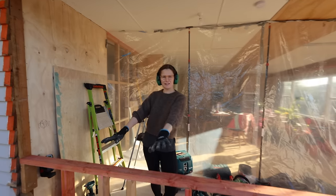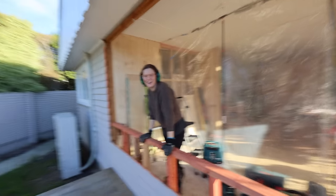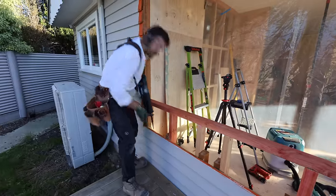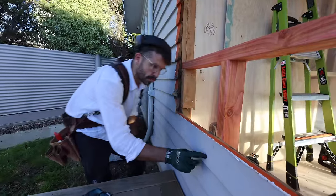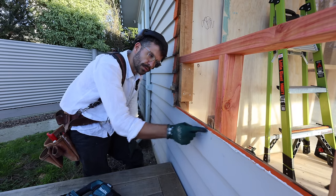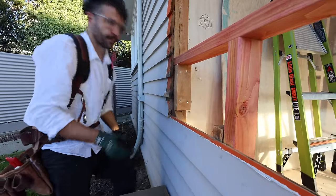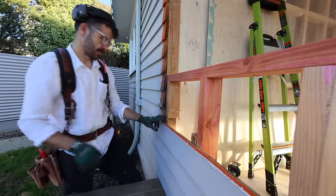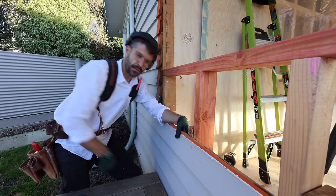You'll be here passing your drinks and your food out to your friends - exactly. You really shouldn't nail the top of weatherboards, but people always do it because it's easier. You always just nail the bottom of weatherboards, because a weatherboard will expand and contract with moisture - it'll get wider, it'll get skinnier. If you have two nailing points you've got two things fighting each other as the board expands, and then it cracks. If you only have one nailing point the weatherboard is free to expand and contract. So only nail the bottom, and don't nail it into the weatherboard below - because then again you're giving the weatherboard below two nail points.